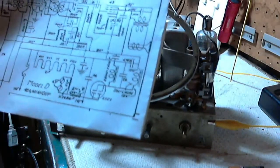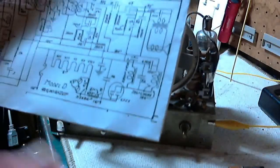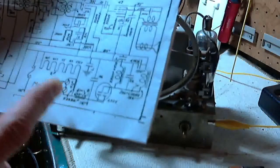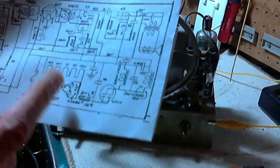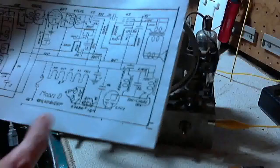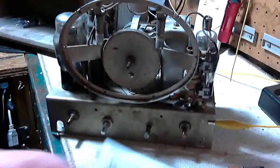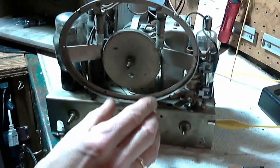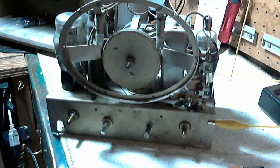And then as these guys warm up, the current begins to fall, you'll see these lights come down in brightness. And then, once the whole radio gets operating, these bulbs become brighter again, because I think some of the DC current that's flowing through all the tubes in the radio flows through these light bulbs. So that's normally what you should see when you turn on one of these radios. These lights get bright, dull, and then they come up again, usually just as the sound is coming on.